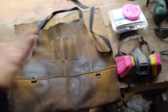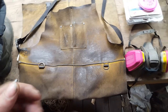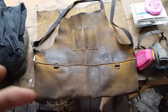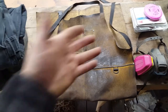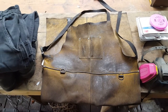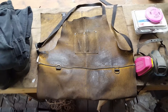When it comes to protecting your hands, I wear gloves of various different types — welding gloves, general shop gloves — depending on what I'm doing. If I'm doing something like running a belt sander, you may notice in some of my other videos that I do not wear gloves. There's a very good reason for this: with high-speed belt sanders or bench grinders, if you're wearing gloves and your fingers are very close to the running belt or wheel and it grabs those gloves, it's going to pull your hand into the machine. I'd rather take skin off my knuckles or burn my fingertips a little on a hot piece of steel than pull my hand into a running machine. When running bench-top tools like that, I don't wear them. If I'm using a handheld angle grinder, yes, I do wear them.